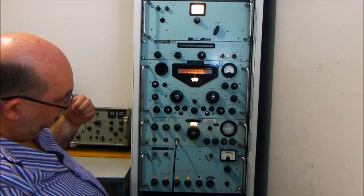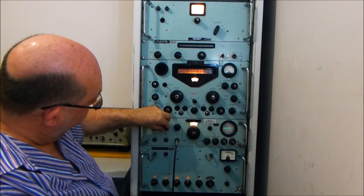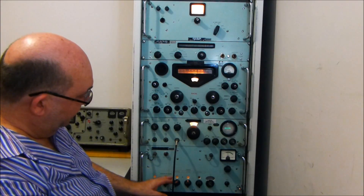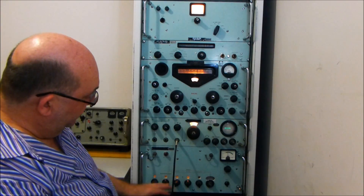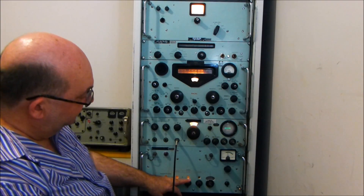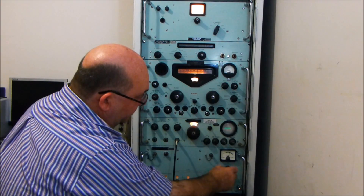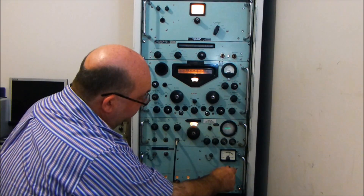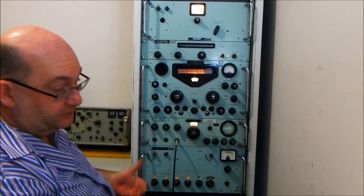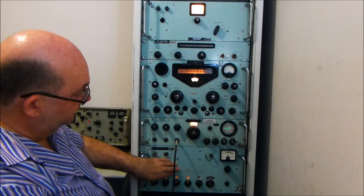While I'm waiting, I'll maybe take you through a few more details on the units. The MA350 synthesizer unit is basically a decade preset synthesizer. It's multi-loop — there are four actual synthesizers within here, all cascaded into one another. The output of each of the oscillators and synthesizers is monitored, as is the main network output. So we can actually identify, if there is an out-of-lock fault, which of the modules internally could be at fault.